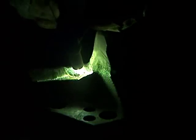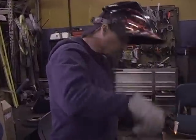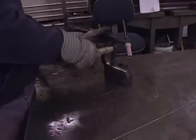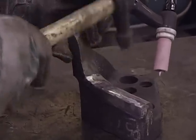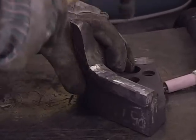What he's doing is he's putting on the Vulcan T4400CG controlled grain onto the tool steel. Now he's peening. The reason he peens is to stress relieve. As that's cooling down, he's helping it relieve itself because the weld deposit is hot and it's cooling down.